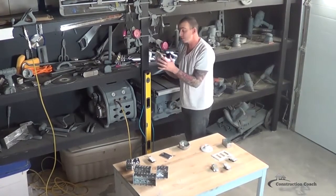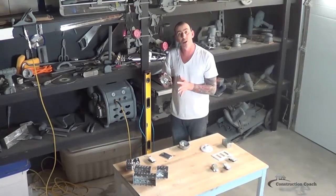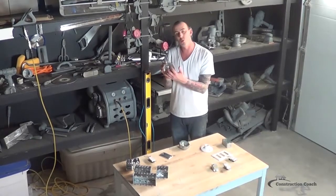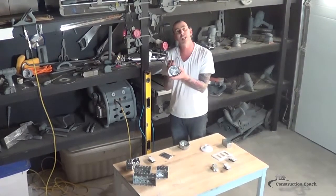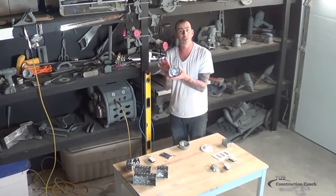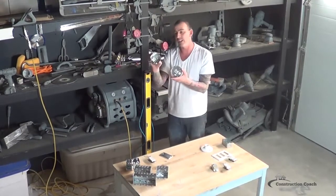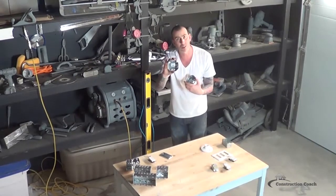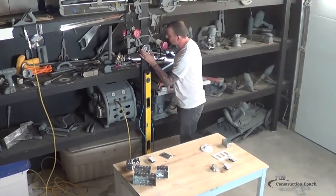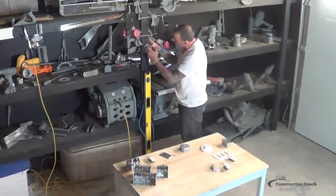These are very handy boxes. Another space they are generally used is for exterior lights. Electricians will just screw these right surface-mounted onto the sheathing and bring their wires in through the back. It is recommended that when you get it into the sheathing you also get it connected into some solid wood blocking. It's a lot easier than cutting a giant hole that has to be perfect to fit around an octagon box — you can just mount the pan box flush on top, bring the power through, and screw it onto the stud.